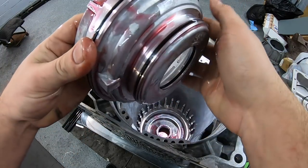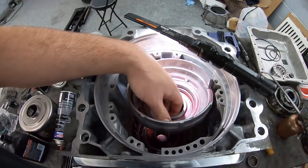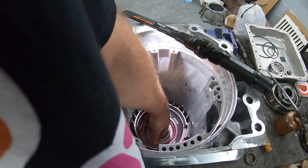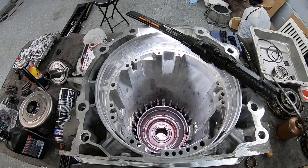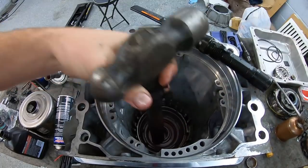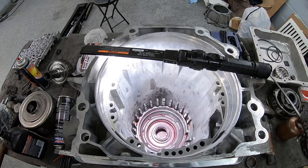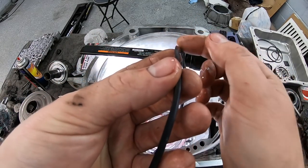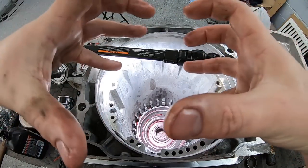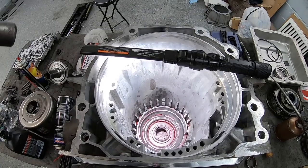Dropping the piston in very carefully. It's going to bang against the back of the hammer to get it all the way down. Being careful with the seals, but since these are square cut seals you don't have to worry too much - if it was a lip seal it could potentially get nicked or go in weird. As long as everything's lubed up, these seals sit pretty tight against the piston, so just make sure everything is lubed up and it drops in nice and straight.